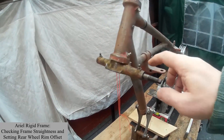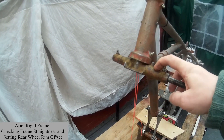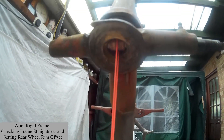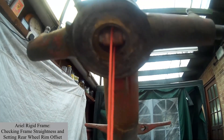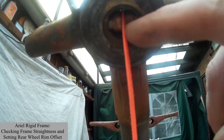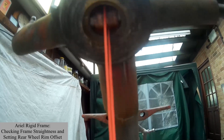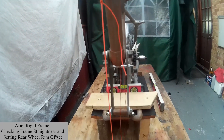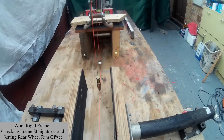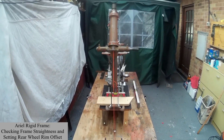You can also, by putting in the steering stem and the bottom yoke, thread a piece of cord through so that it sits centrally. I've just made a spacer out of brass with a groove in the centre for the string to align to, and then you can drop another plumb bob and it should then line up with the datum line to show that the headstock is square.